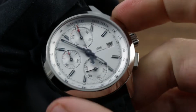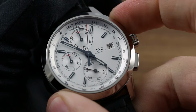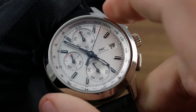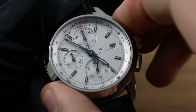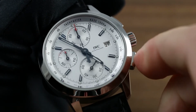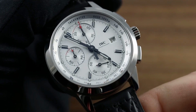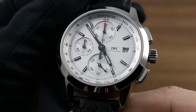This watch is a chronograph, and it is a traditional chronograph featuring a pusher at 2 o'clock responsible for starting, stopping, resuming if desired, but ultimately the watch must be stopped prior to the 4 o'clock pusher being pressed to reset. Always start and stop prior to resetting. Attempting to reset while the chronograph is still running will cause significant damage to the movement, so always take care to stop first.